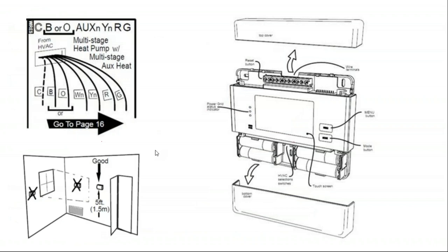So I recently installed a smart thermostat. Actually gotten into a couple. One problem we ran into with a recent smart home is the air conditioner contractor only wired 4 thermostat wires instead of all 8. The reason they did that is their proprietary Rheem Econet thermostat only needed the 4 wires. And so the homeowner wanted to install a different thermostat, the Nest, and they couldn't because the Nest requires a traditional 8-wire thermostat, and they didn't have those all connected up to their air conditioner.